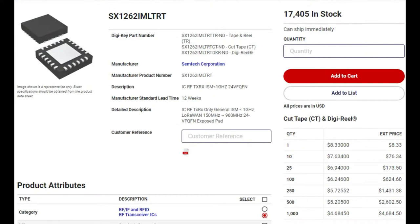The other half is the SX1262 radio, which communicates over SPI. Anyone who's done LoRa or LoRaWAN with Python or Arduino is familiar with the SX series of chips. This radio can also do FSK and probably ASK — you don't have to use LoRaWAN. You can do simple modulation as well, but chances are if you're getting this, you're paying the extra couple bucks because you want the LoRa licensing.